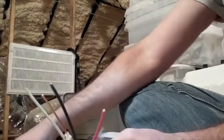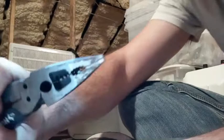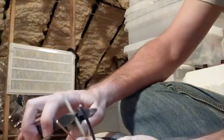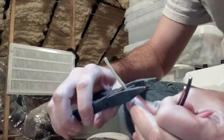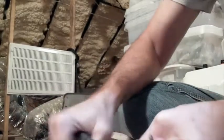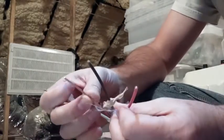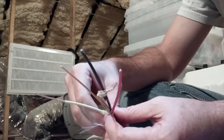You've got three insulated wires and one bare wire that is the ground. We are going to be twisting together the black, white, and ground, and then just capping off the red one — the evil red wire — so that's not a problem. Now that these are exposed, you take your wire cutters. The holes in the stripper have numbers next to them; since this is 12-gauge wire, you simply put the wire in the hole that says 12, squeeze together, and pull — it exposes the wire. We'll do that for the rest of these wires, then twist together the live wires to provide power to our new heater.